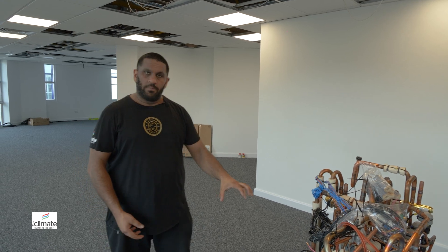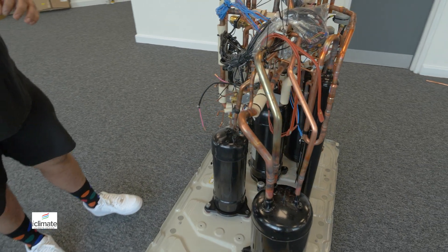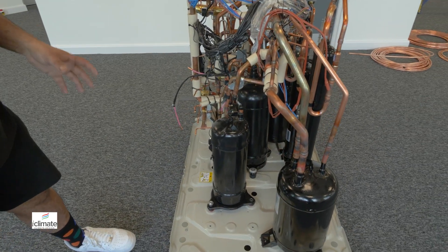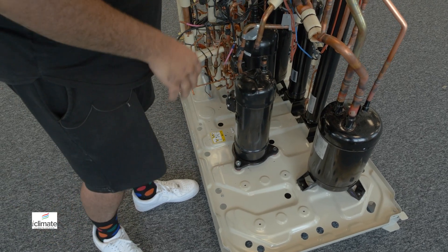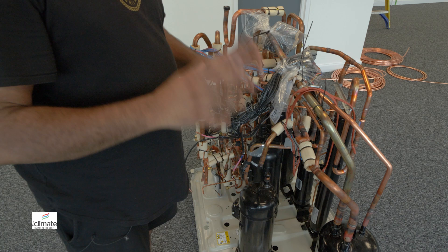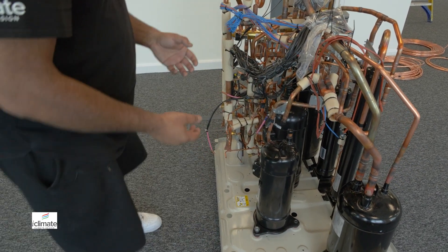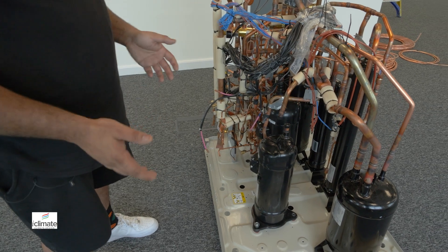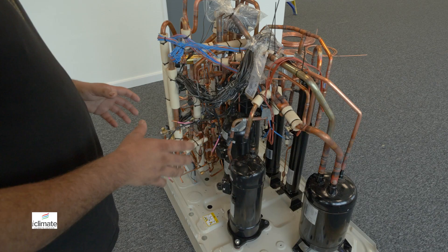The reason the compressors are different sizes is to meet the energy efficiency demands. We start with a smaller compressor on startup, meaning they can work on a very small starting increment depending on the load from the building. Upon startup, the PCB and the systems will read the load through the sensors and the numerous valves and dictate what is required for the speed of this compressor. These are inverter-driven motors — they essentially speed up and slow down on the frequency of the hertz according to the demand that the unit is telling it to do.